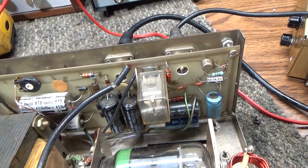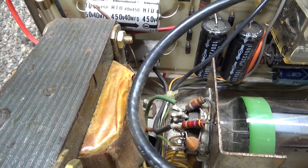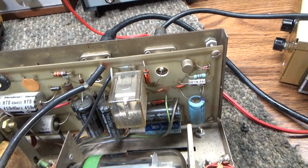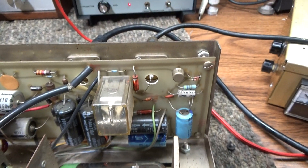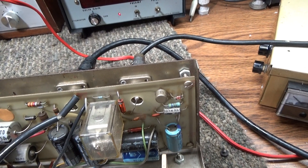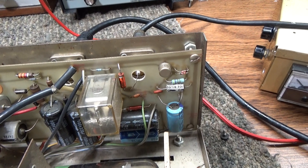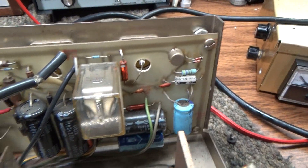The way I say it isn't a true modulator is because the tuned input is not variable — it's fixed. It's there under the tube; you can see the coil under there and you can't adjust it. So you can't vary the dead key or the power output at all. The only thing you've got is the so-called tune cap on the output side. As I've said before, you never detune the output — you always tune for max. If it had a variable bias or a power adjust for the screen, input side, or bias, you could turn it down, but not with the output side. This one doesn't have any input adjustments at all.